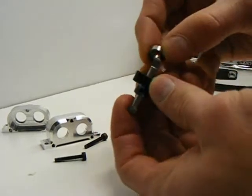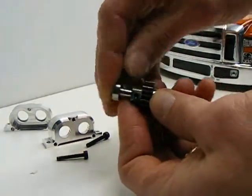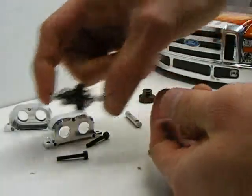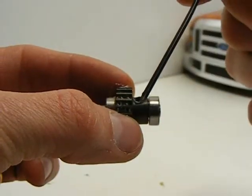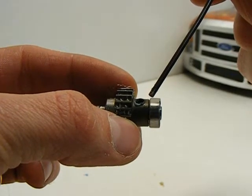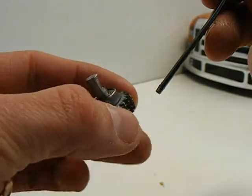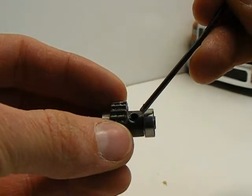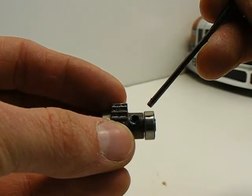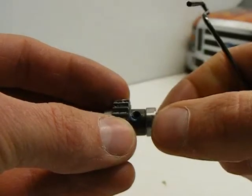This one's assembled, and then we're going to add the bearings to each end — one bearing on this end, and one bearing on this end. This unit is now ready to install. Here's a little assembly tip: you see that space right there between the bearing and the end of the gear — make sure when you're doing your assembly that there is no space in there. On this side there is no space between the gear and the bearing. If you have a space, you're going to end up with a little bit of binding in the case. Make sure that you push that bearing all the way to the end so that there's no more space. That way your case will have the most freedom when it's rolling.